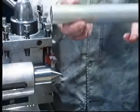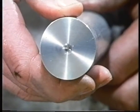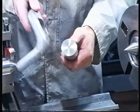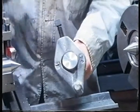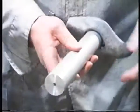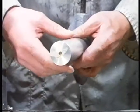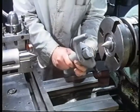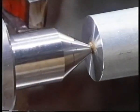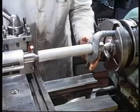On a lathe, work can also be held between centres. Before mounting the work, each end must be centre drilled. To drive the work round, a driving dog is fitted to the headstock end of the component. This will locate in the driving plate. The centre hole at the other end is greased. Can you think why only one end? Here the work is positively restrained in all three directions.